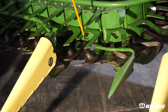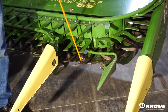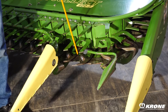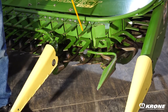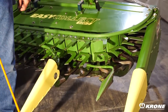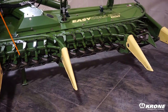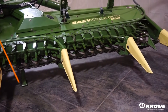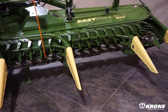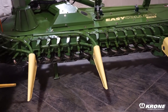The knife and hook design has also been improved and made more similar to the trifold heads. Each link is now a single hook and a single knife. The previous design bifold had a double and then a single on alternating patterns around the head. Going to this design makes parts much more common and much easier to replace. What hasn't changed is the crop flow concept — crop comes in, it is scissor cut off and gathered by the hooks and brought to the center and fed in butt end first to provide more uniform chop quality and consistency.